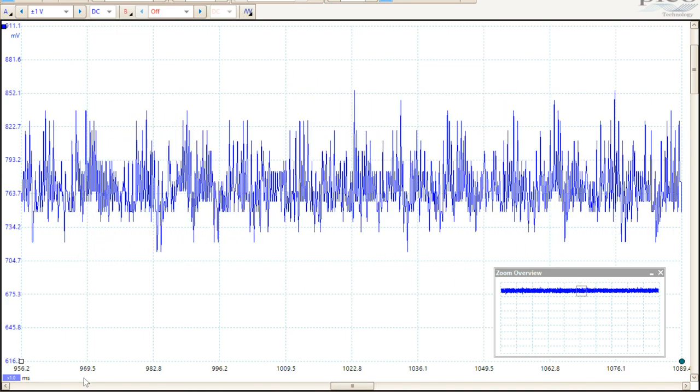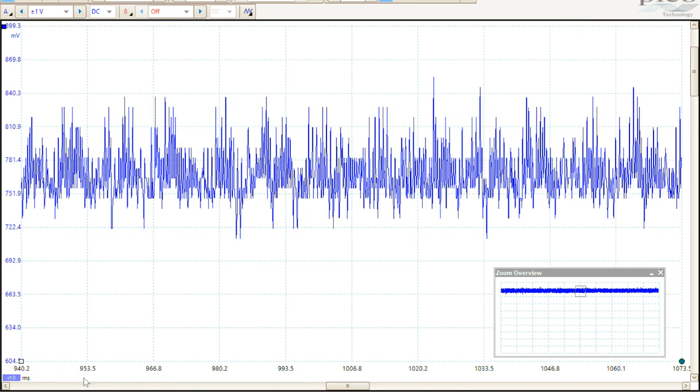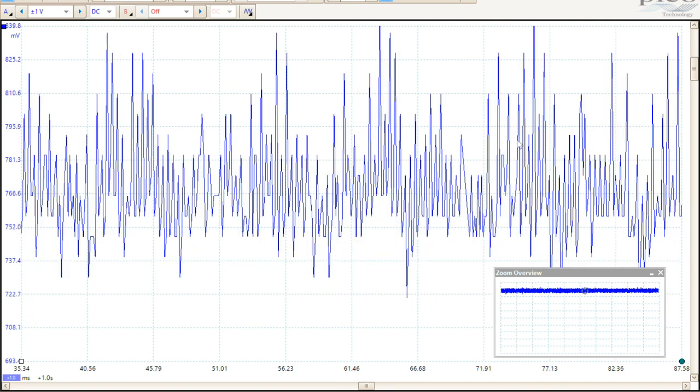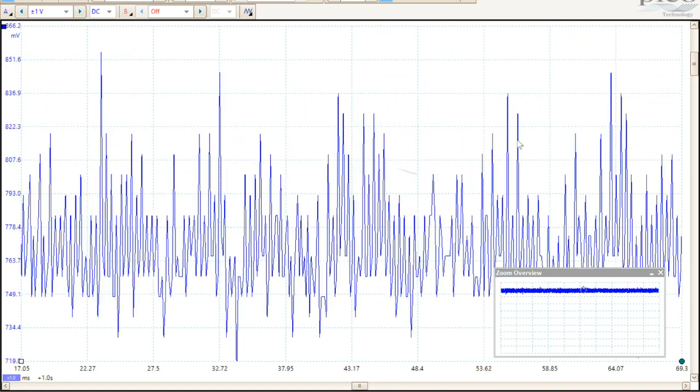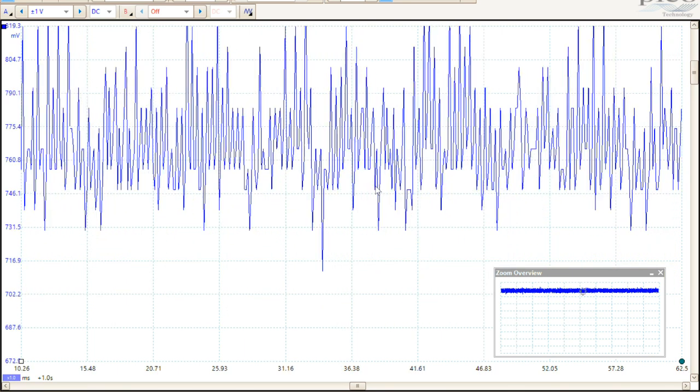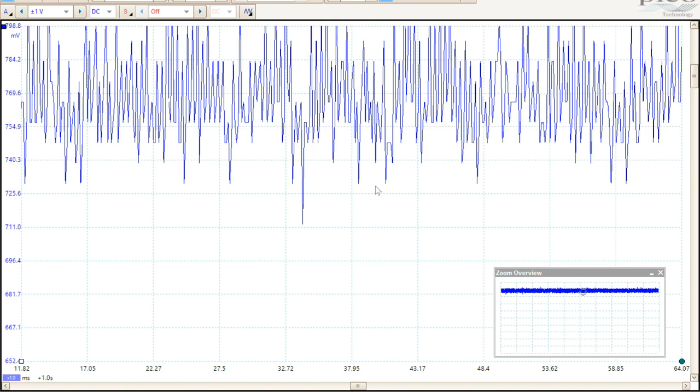Let's just do minimum and maximum first. Looking across the line, I've got a peak just here and another one there, and that one looks about the largest. So we'll zoom in on that. We do jump around a bit at the maximum. And that's giving us — if we convert that to the amperage — 8.54 amps as a maximum. And then if we look at the minimum — there's one — just lining it up with the line — we've got 7.12 amps. So that's our minimum draw.